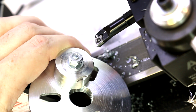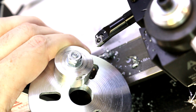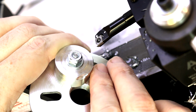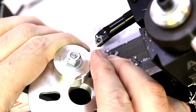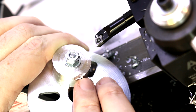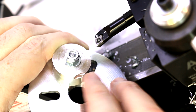So this is an example where the work holding that I had set up really wasn't sufficient. I had mentioned the deflection of that one screw and how we needed something on the other side to kind of prop it up and give it more tension. The vibration of the interrupted cut ended up causing that to slip off. First just slip and then slip off. And so you can see we have two different steps of cuts here that we were making.